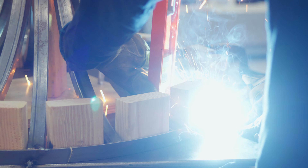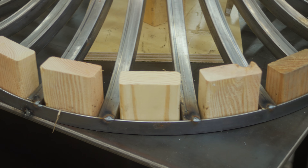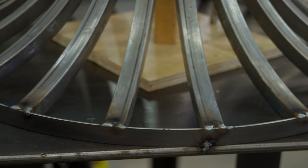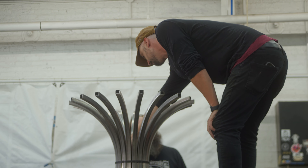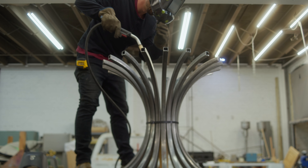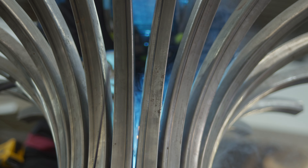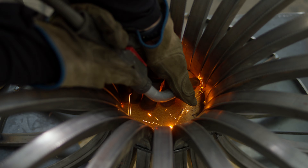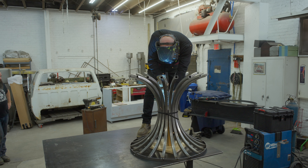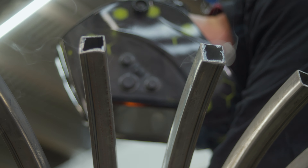It was super nice to have an extra hand doing this. Andy, if you're watching — thank you again and I owe you a case of Old Style. With the bottom welded together, we made our way to the inside of the legs. The best way to weld the middle was to attack it from the top, since we didn't have to move anything because it was still tacked to the welding table, and it also hid the welds really nicely. I like to hide my welds so the piece looks like it was bent and shaped from one piece of metal. Welding the middle gave me more peace of mind that the metal legs would have no way of shifting over time.